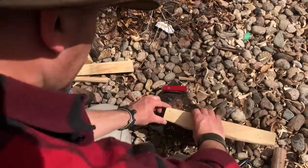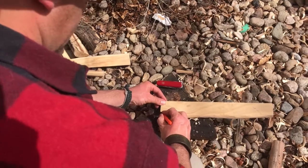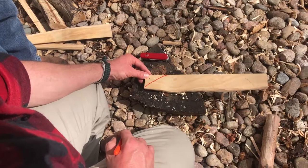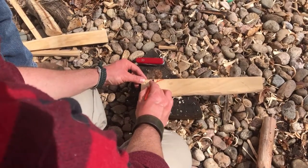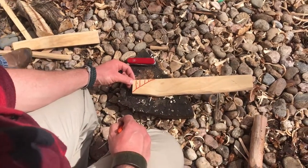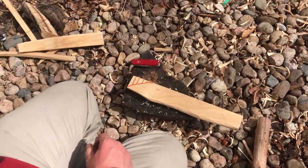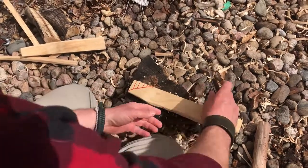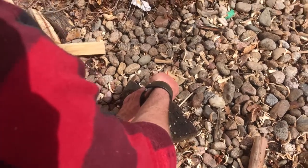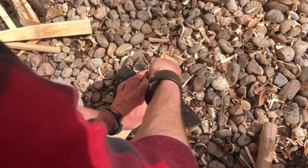This is the same way we make feather sticks, except I'm going all the way to the end of my wood to get rid of all those angles. When this is slid back and forth in a hand while kids play or roughhousing, it should feel really comfortable — no danger of splinters. See how I can rub it in my hands — no splinters, no pain. You can take some sandpaper to it later, but if you got rid of all the little angles and splintering portions you shouldn't have to. Handles always seem to mess people up — just hold the wood the way it would be pointing when it's a crossbow, and from the crook of your thumb down to the angle of the wood, that's the line you want to follow to make a handle. We're going to draw this in so you can see it, but you could scratch it in with one of the blades. We're not going to hack it all off in one piece because we'd probably split or mess up our handle. We're going to make a series of relief cuts — just like using a power tool to keep a hacksaw blade from breaking — and these relief cuts act as stop cuts, allowing us to apply force in the direction we want without risking splitting out or hitting anything beyond our blade.